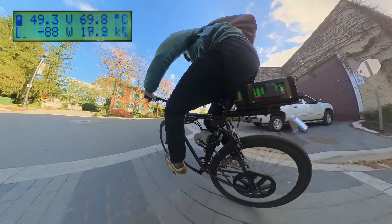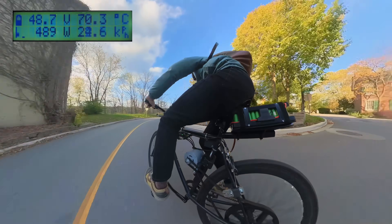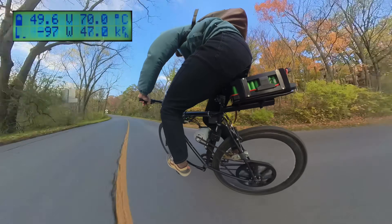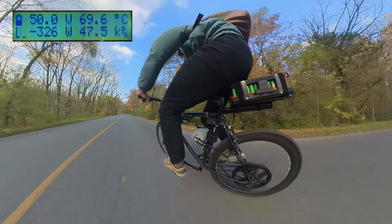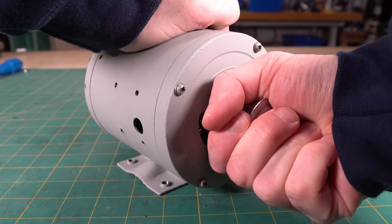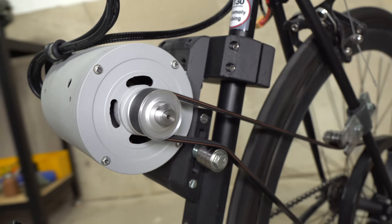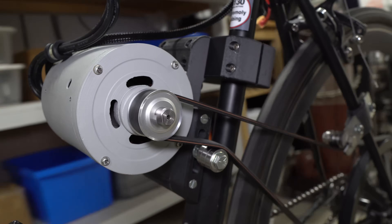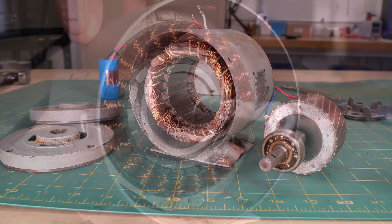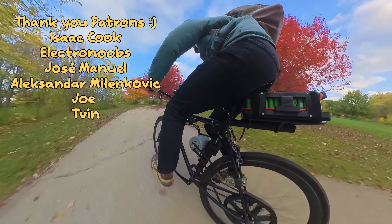I began to lose speed near the top, but the motor still did a great job. The temperature peaked at about 70 degrees, which is totally reasonable for a hill climb like this. Throughout all my testing I didn't run into any issues and there was nothing I had to stop and fix between runs. One thing I didn't expect before starting this project was just how much cogging torque this motor would have. Cogging happens because the permanent magnets on the rotor are constantly lining up with the stator slots, which creates that notchy resistance when you try to spin it manually. Luckily this doesn't cause any problems while riding, but you can definitely feel it when pushing the bike at low speeds. This project was a lot of fun, and I think it's really cool that you can turn a single-phase induction motor into a powerful brushless DC motor. Thanks for watching, and I'll see you next time.